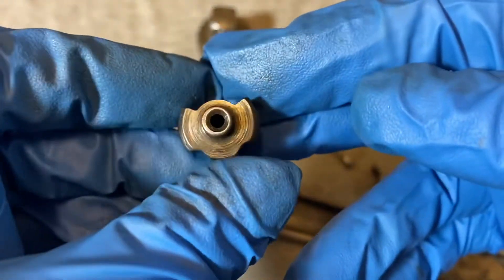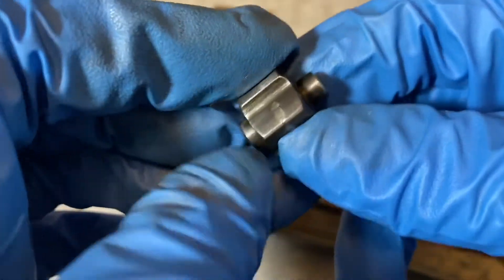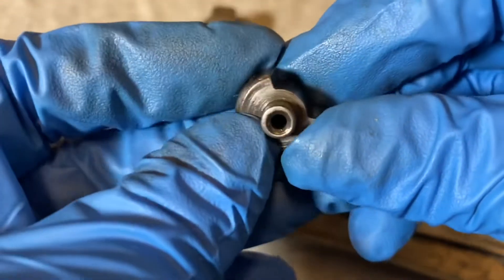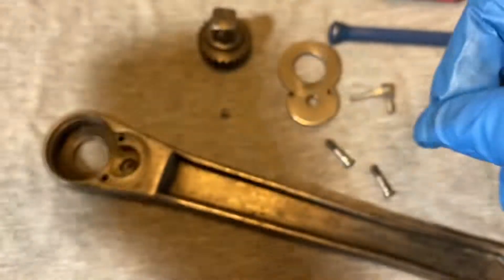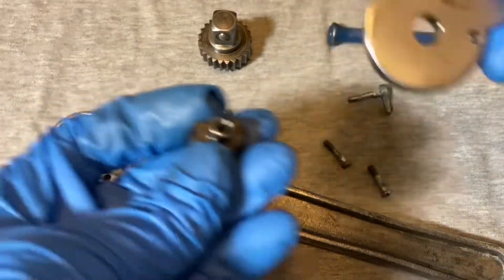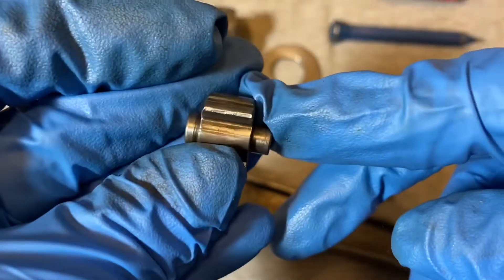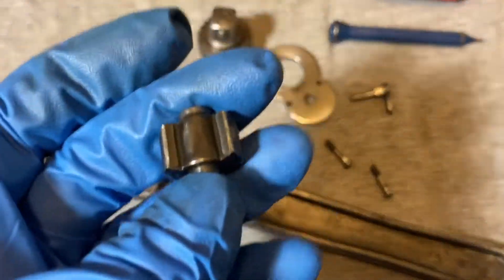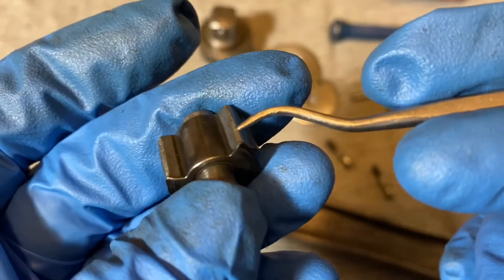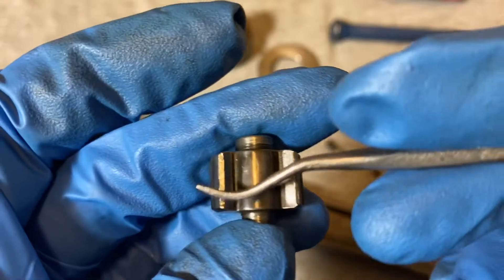Here's the pawl — just one tooth. On the other side there's a little rubbing there from the ball underneath the pawl, and this is the protrusion that goes through the plate. This one looks a little roughed up. If you take a look at the top of the pawl tooth, it looks pretty ragged on that one too.